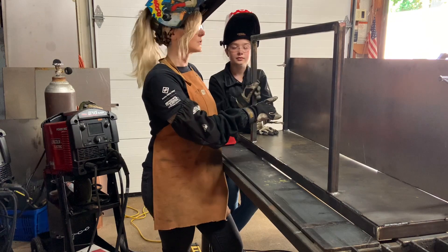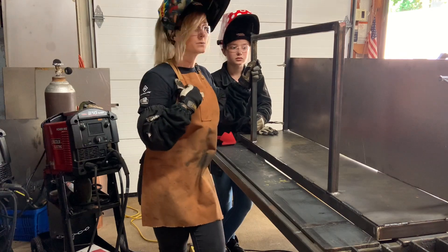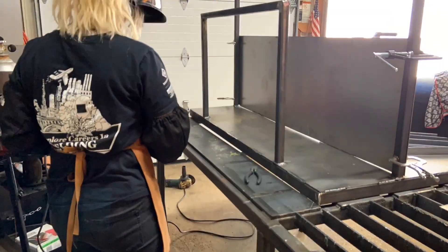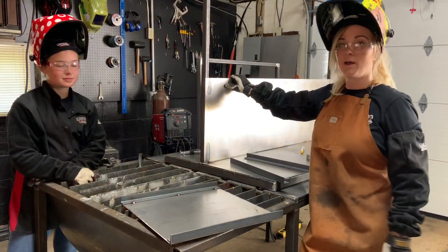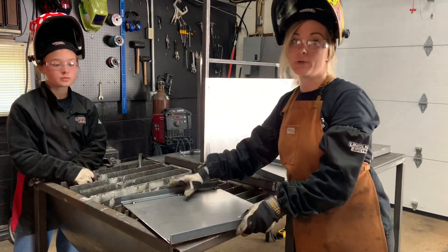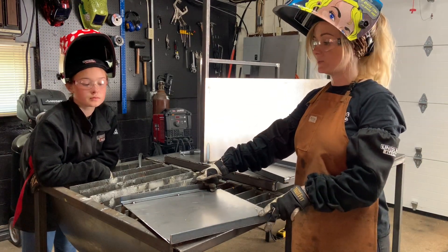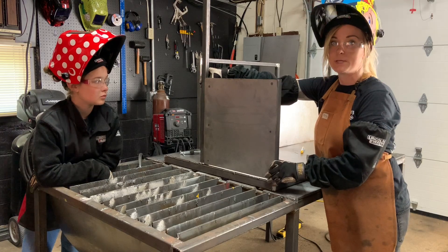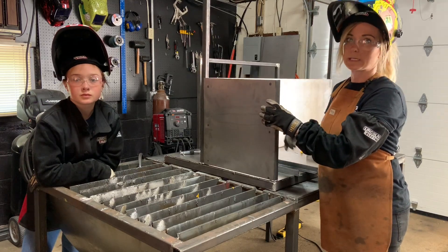The first wall of our bins is ready to put on. These are going to be some vertical welds, so I'll tackle these ones and have Briley watch. For the rear wall, a simple trick is to take that one inch angle and put it on either side of those 16 by 16 pieces of sheet metal - that way when you set it up you have something to clamp down and get them welded in nicely, without fighting with magnets.